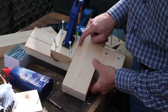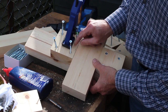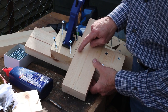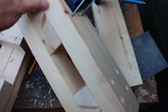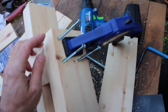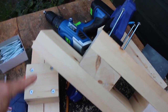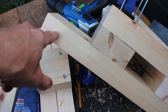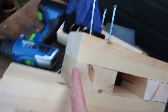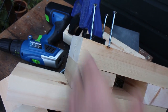Allowing a little bit of expansion if it gets wet — and I'm not going to glue this one, just screw it, so if I do need to adjust it later I can. I'm now securing the top piece to the poppet, so the lathe bed will go through here. The crank handle and the tailstock piece will be going through there, so I'll be drilling that through later. The tool rest will rest on here, so you do want to get this fairly smoothly flat and lined up.